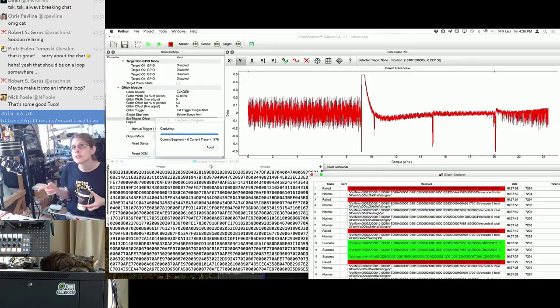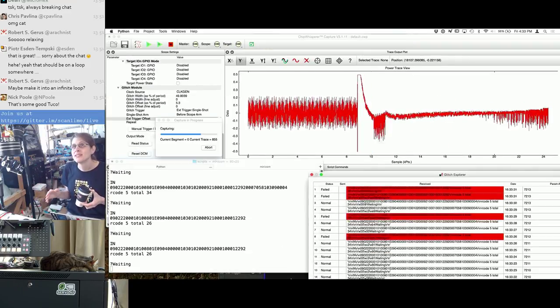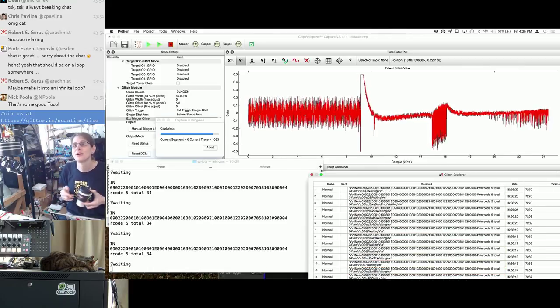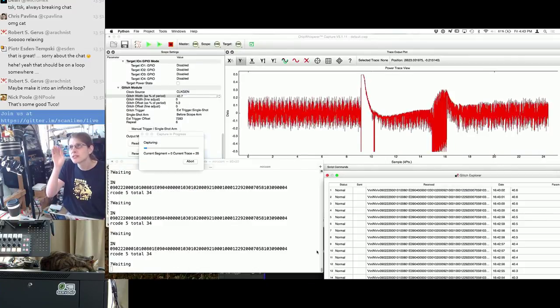And then afterwards, it keeps running, and it keeps servicing those USB interrupts and delivering more packets. But because that length got corrupted, it ends up reading way past the end of the buffer and returning USB packets with all of the firmware. And so that's why you see a difference when it starts getting close to the right location.